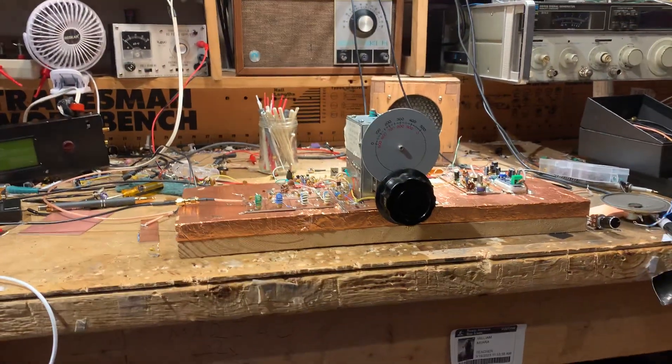I needed it to look like 50 ohms on either side because the TIA amps, which you can see here in red — thank you, Todd, K7TFC of mostly DIYRF — these TIA amps take whatever you put in at this side and make it look like 50 ohms over here, and vice versa. So I just made the crystal filter look like it would go into 50 ohms, and there we go, 50 ohms all the way through. I've got space here for one more TIA. The top TIAs are the received TIAs; the bottom TIAs are the transmit TIAs — termination-insensitive amplifiers. I ran out of boards, but Todd kindly sent me a few additional boards, and I'll build that when I start working on the transmitter.